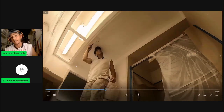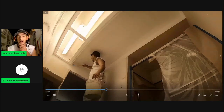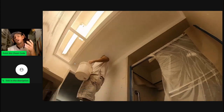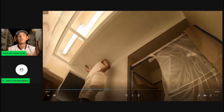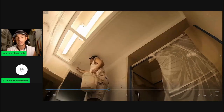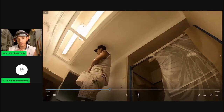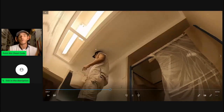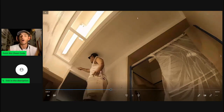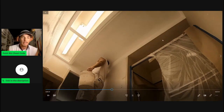After you've got the wall sanded down or cleaned, go ahead and start applying your paint. I like to do a nice thin skim coat as the first coat. You don't want to put a heavy first coat on in the bathroom because you run the risk of trapping moisture underneath that top layer — latex, acrylic, and enamel, depending on what type of paint you're using. So do a quick skim coat after cleaning, and then once you've got your ceiling all the way completed, you can go through and finish the walls in their entirety.